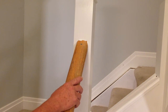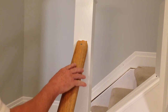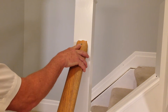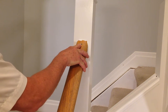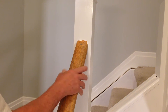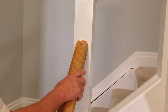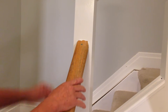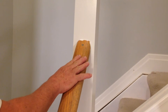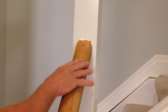This is a very typical subdivision type handrail installation. As you can see here, the railing system was installed countersunk with a fastener system screwed through the face of the handrail. This application is a very fast way to install handrails, but really it's not correct. At the end of the day, this would be plugged with a matching wood plug, sanded and finished. What we're going to show you today is a better way to fasten the system, which is invisible but a stronger system.